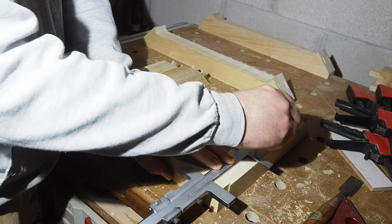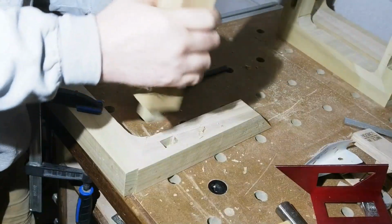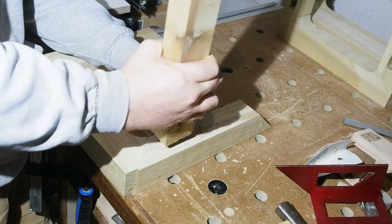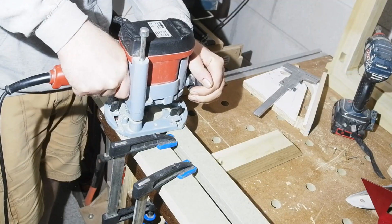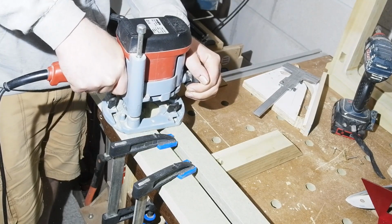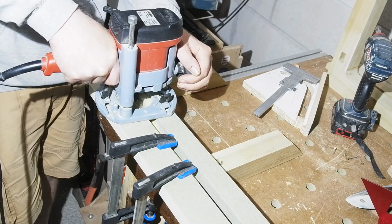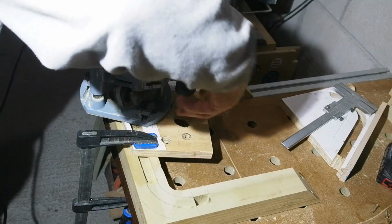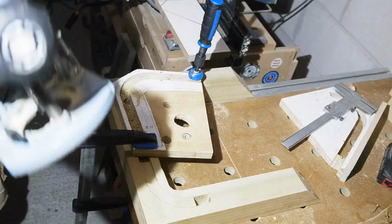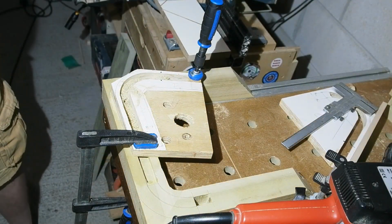The receiving mortise, marked, routed, squared. Linking up with the mortise is the housing for the upholstery, just 6mm deep. Rather than make a specific template for this, I'm just reusing ones from the main chair for now. The angle's a bit more acute than the 90° needed, but this stool's just a test bed, not a piece I'd sell, so it being not quite the right radius matters not.